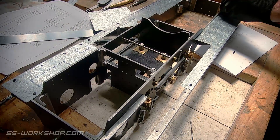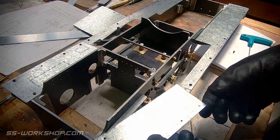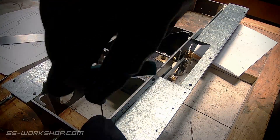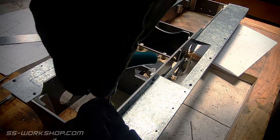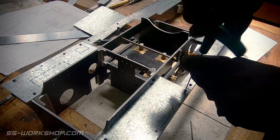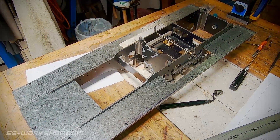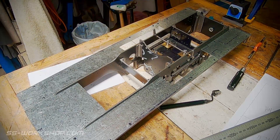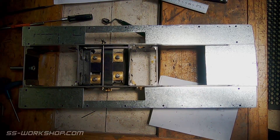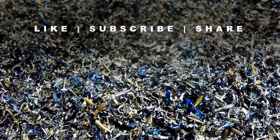The footplates are fixed down using M2.5 button head screws. You'll also notice I've left a cutout on the side — this aligns with the pocket in the side tank, which provides access to the workings. You may have noticed that the footplates extend over the buffer beams at either end. This is because there are timber buffer beams to be installed, and the rear also has a support angle which was used to extend the footplate in the cab. Thanks for watching, and if you enjoyed this video please like, subscribe and share. Catch you next time.